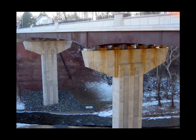But the staining here took place before the concrete roadway was in place, when the exposed steel could get wet and the runoff washed down over the piers and abutments. This is very typical of the use of this kind of steel, and this occurs all the time.